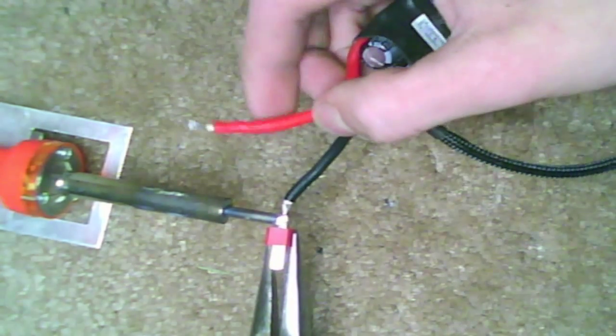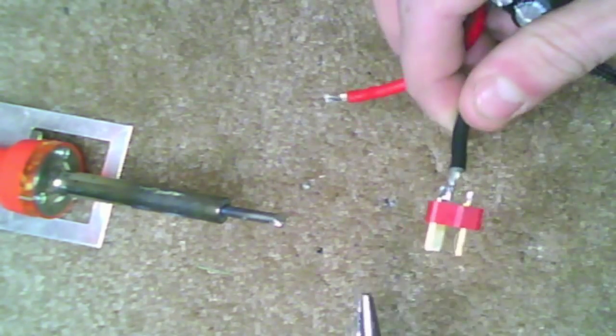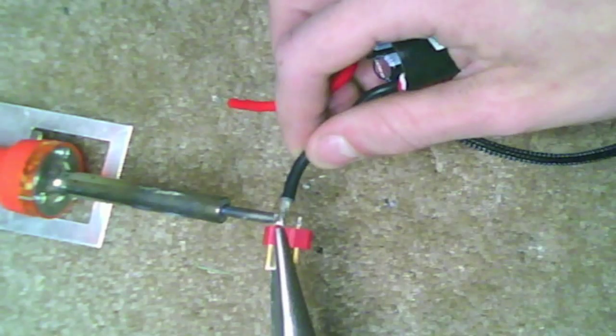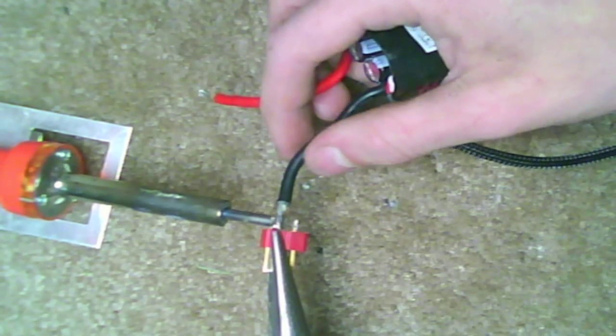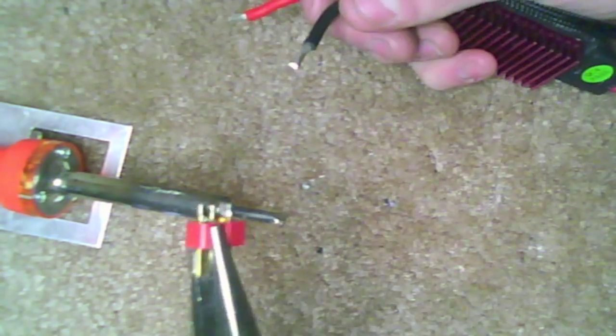And it popped right off. The solder will kind of pull a little bit, so if you just pull it off and let it bubble up. We will pre-tin it a little bit more but we will still keep that solder on there for the next one. Go ahead and do this one — same thing. Let it sit on there for a minute and usually it will just pop right off. There's our Deans.